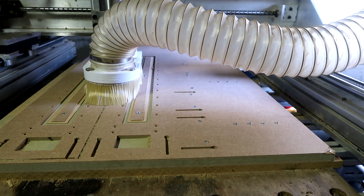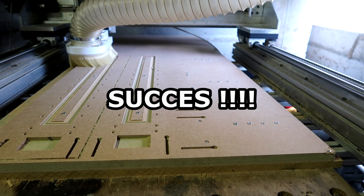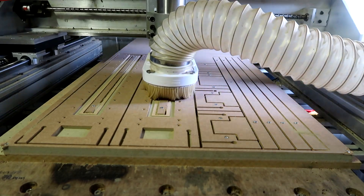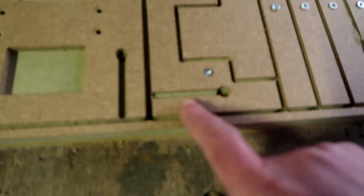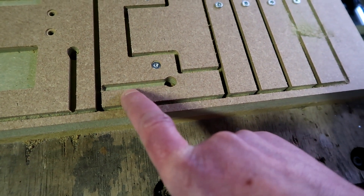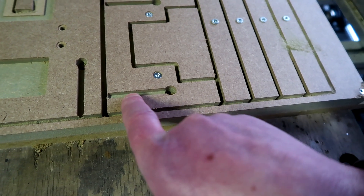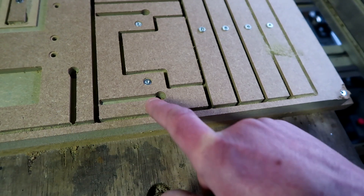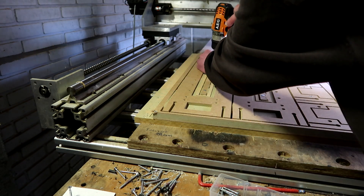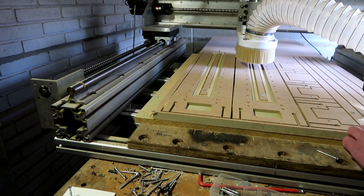This is the moment - will it fail or won't it? So an M6 thread is gonna sit in here and one of these sideway nuts. As you can see, this is six deep already. Since it's gonna be a combination of this part and this part, it should be three millimeters deep. Anyhow, I think six will work, but then I probably will not use this slot. I'm gonna run the cut all the way through the part again because that's gonna save me a lot of work cleaning it up.